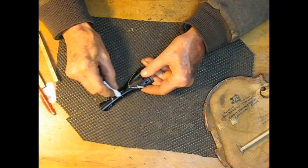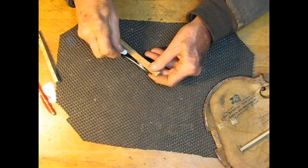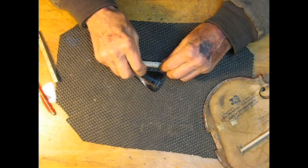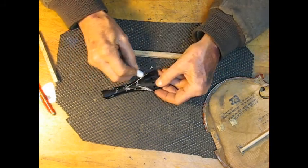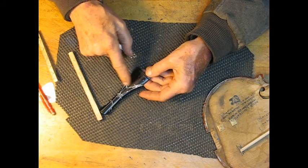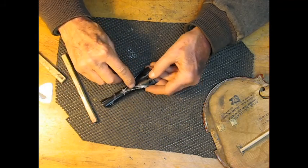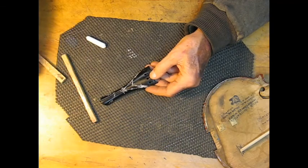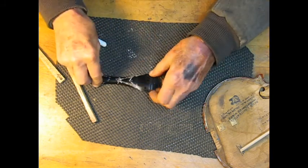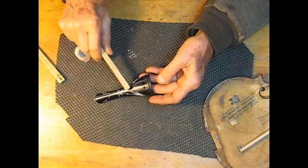From the acoustical center, we're going to draw a line from there, and we're going to draw one down this way. The parts of the tailpiece that are affecting the tap tone frequency out here are all in this little triangle. We don't want to touch these Mode 5 lines, and of course we want to leave our acoustical center. I'm going to take a little scraper and listen to see how the tone changes here.